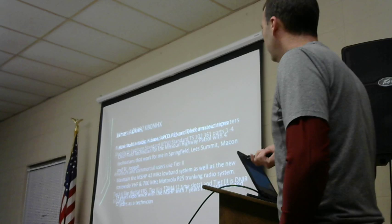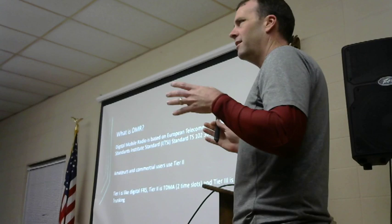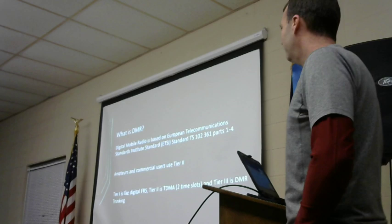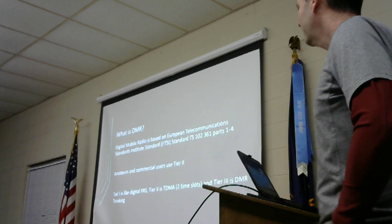So what is DMR? This would be our baseline we start at. If you know anything about P25, that's the digital standard that public safety uses in the United States. DMR is P25 in the rest of the world. I think of it as P25 is inches and feet, DMR is meters and centimeters. So that's one reason why the cost is lower than P25. But amateurs and commercial users both use DMR. It's perfectly legal. When people started using DMR first, there were some questions of whether or not it was legal to use on the ham bands. That has all been taken care of, and the FCC is okay with it.